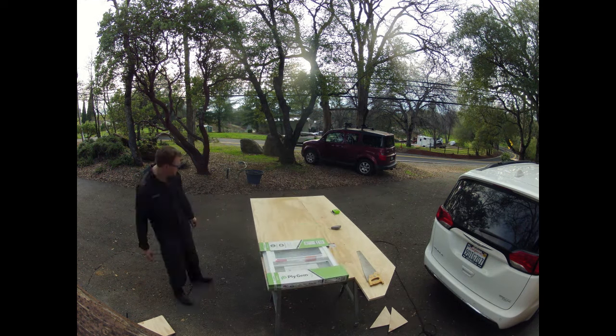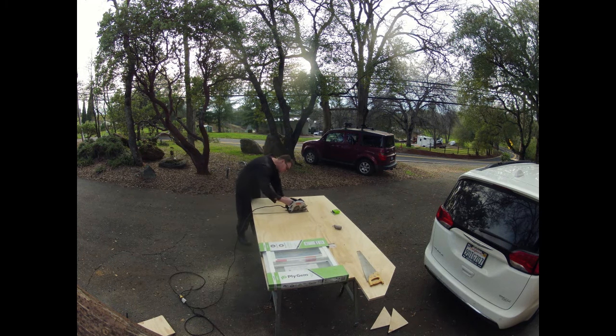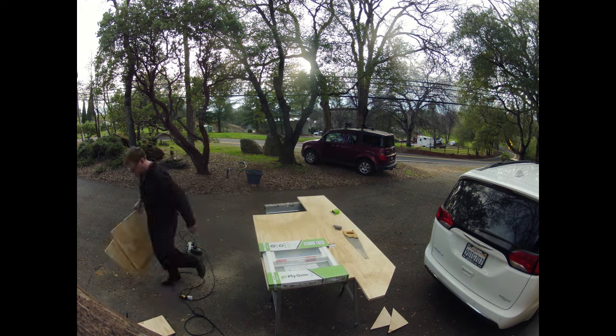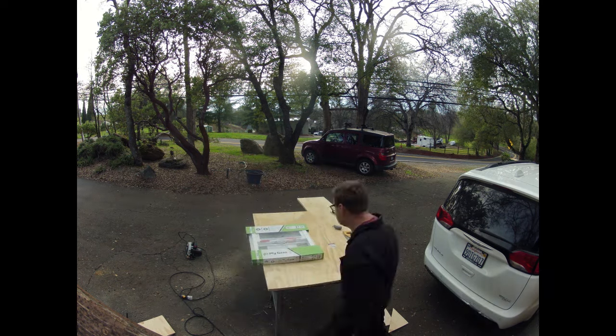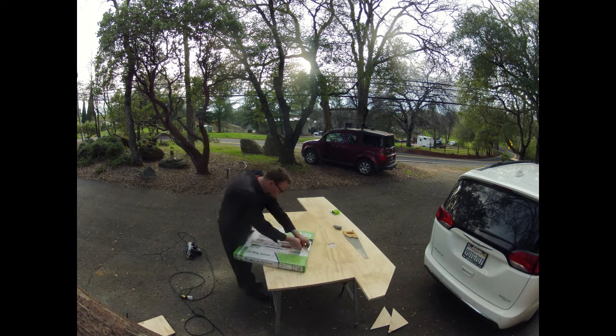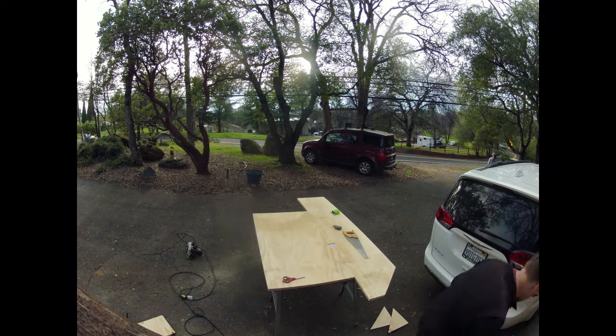When you're using a circular saw to cut into a corner like that, you're not able to reach all the way to the corner. So I'll cut right up to the edge and then finish the cut with a handsaw to get a nice crisp edge. It took a little bit of finagling to not cut through the sawhorse — I've done that before. This time I didn't, and I'm very happy about that.